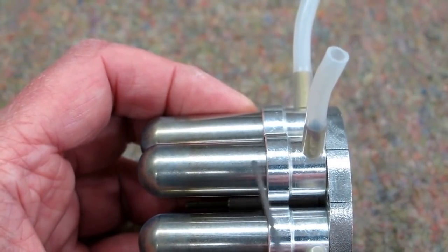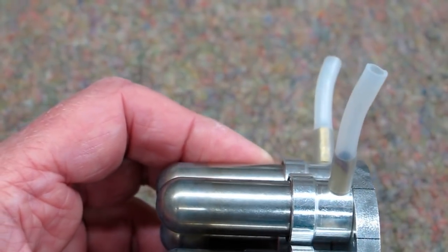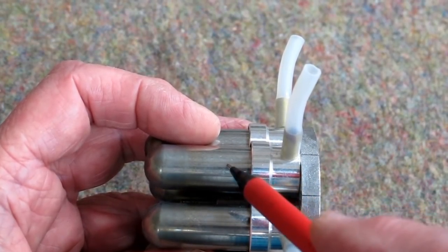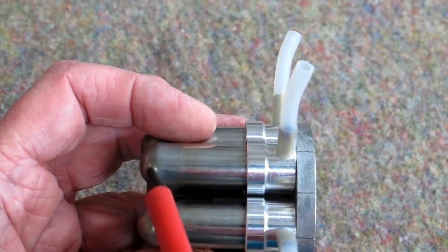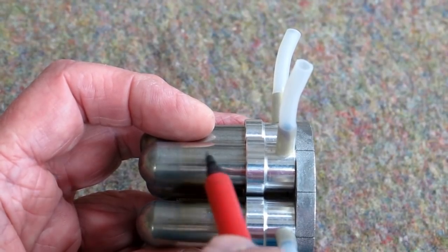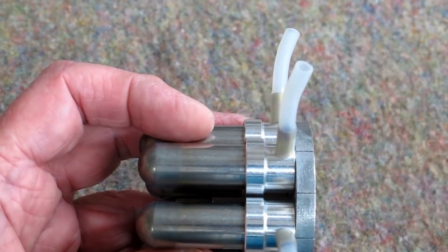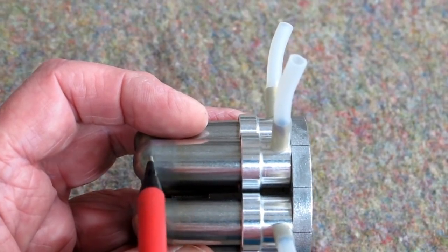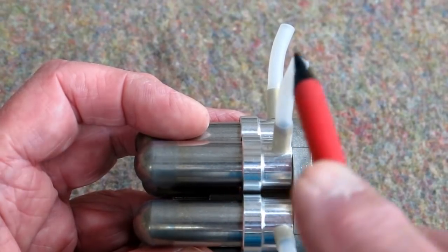After this runs for a while the cylinder does get heated — there is some hot air that works its way up to the cylinder. When the piston is at the top of its travel and the displacer has moved all the way to the end of the displacer cylinder, the air in here is passing over the flame. It gets hot, it expands, and it's moving in this direction. At that point the pressure here is slightly higher than the pressure at the piston, and that slight differential pressure helps move the displacer in this direction. The hot air travels and pushes on top of the piston.